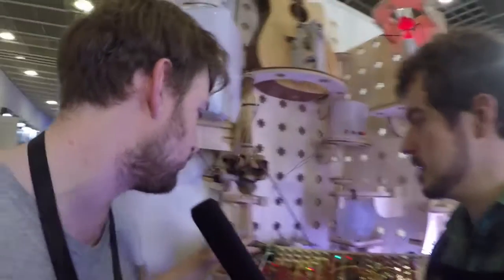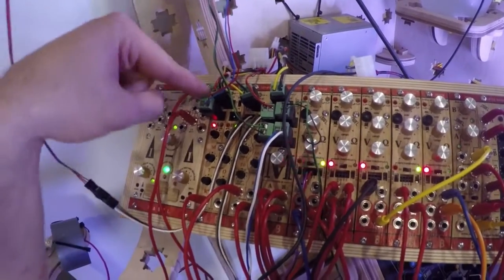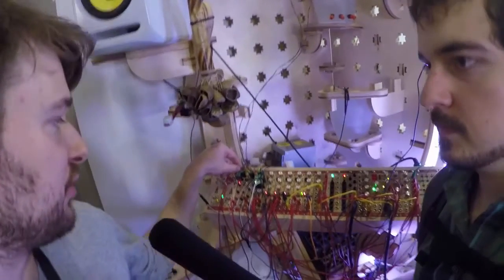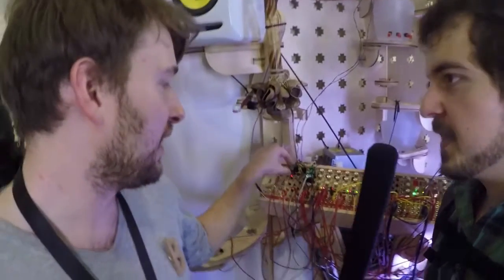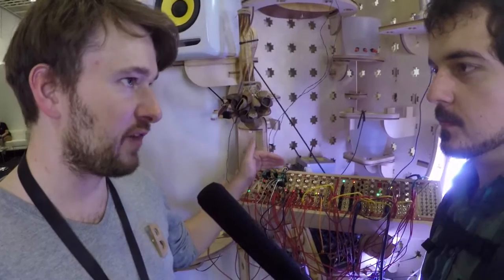On the DC motor driver you have a little switch which passes through the input voltage directly. I have 5 volts in right now — that's what most computer stuff works on — but the circuit can go up to about 20 volts if needed. That means you have an external power supply going into the module at the front. All the modular path is optically isolated from the motor driving path, so there's no ground connection.